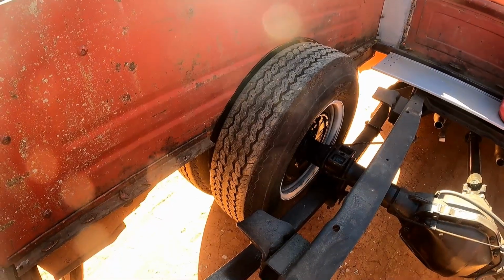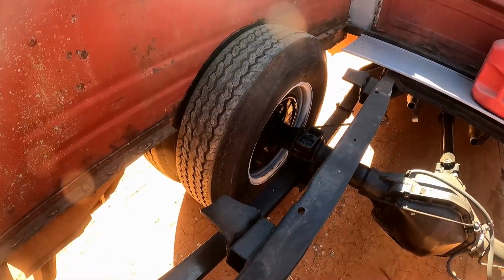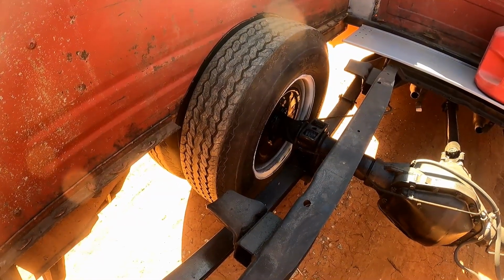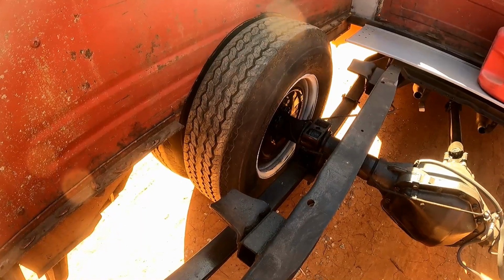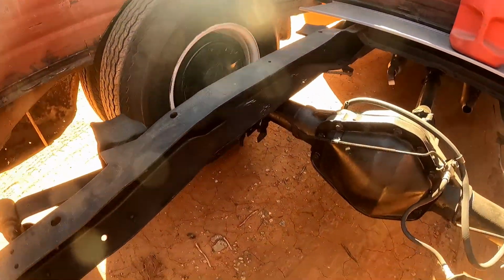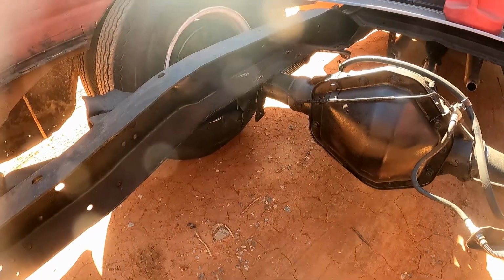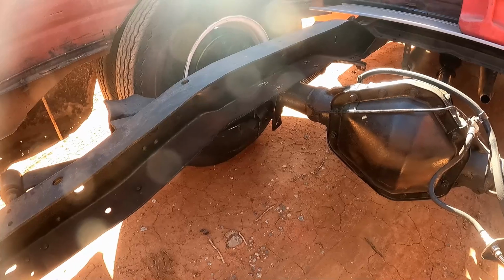So you guys be sure and join me on the next video. We're going to finish up our wheel tubs. We're going to do the C-notch. That way we'll get all of our suspension back, and everything as far as lowering the truck will be 100% done. We're going to have to do something about our shock mounts too. We're either going to have to extend them a little bit longer, or we're going to have to get some shorter shocks, one or the other.